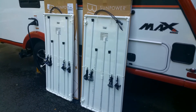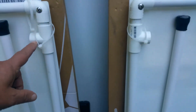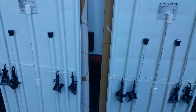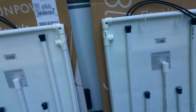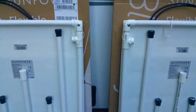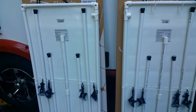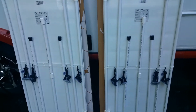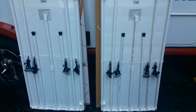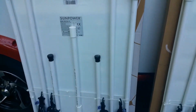Here we have the two panels completed with frames side by side. For the horizontal position, these mounting pieces let you lay it horizontally on the narrow side — they're opposite each other so if you want to connect the panels in parallel with a Y-connector, you'll be able to do that. It's easy to move — just take the screws out on one corner and put it over on the other corner. One thing to point out: I mentioned you need two 10-foot sticks of half-inch PVC, but it turns out you really need two and a half — so for two frames you'll need five pieces, and for one frame you'll need three pieces.